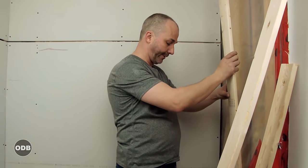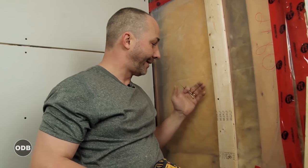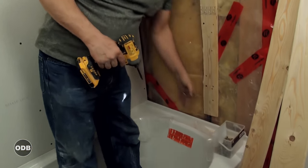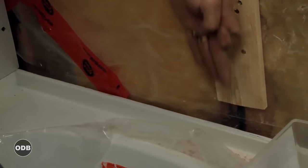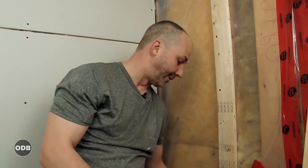And if I'm gonna have a hole here, I can actually get strapping right in behind here. So the purpose of adding the build out is to bring the finished wall over top of the tile flange so that my new tile will go straight down onto the interior of the tub without having any ugly curves or bends in order to make that adjustment.